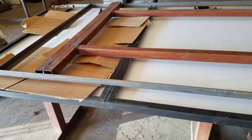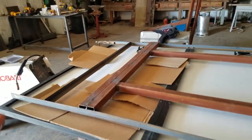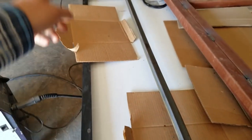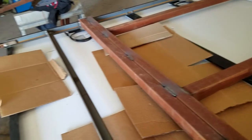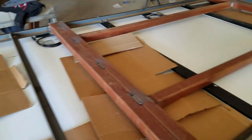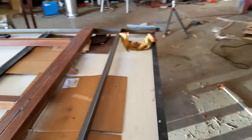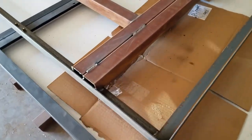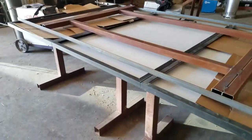So far these only have four bolts in them, and honestly that's plenty. But putting another spot in, the center one will have six bolts in it, and the outside ones will have six in them as well — they'll just be bolted all on one side, with two on the outside. You could probably run another piece of angle iron on the outside edge and get two more bolts in it, but I don't think it'll need it. If in five years the outside ones are all torn off, then I'll know it needed it — but as far as right now, should be just fine.